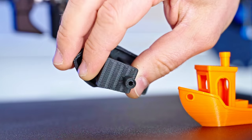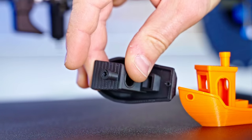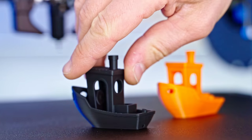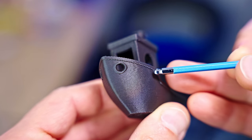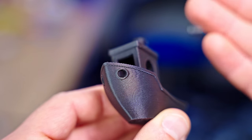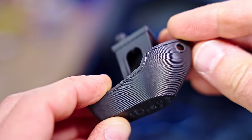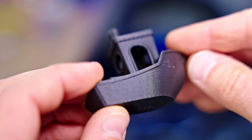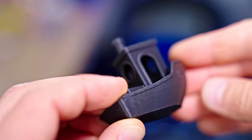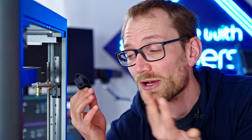Looks really clean. There is a bit of an issue with pressure advance or whatever, where the top infill isn't completely filling in, but this has got to be like one of the cleanest Benchies I've ever seen. The carbon fiber PLA helps. There is some ringing right there. I guess input shaping isn't quite fully tuned in yet on this machine. And there's also a bit of a patterning going on, almost like a delta pattern, but not quite. Also a bit of warbliness back here, but overall details are crisp, and this is on a very high level overall. So that turned out pretty well.